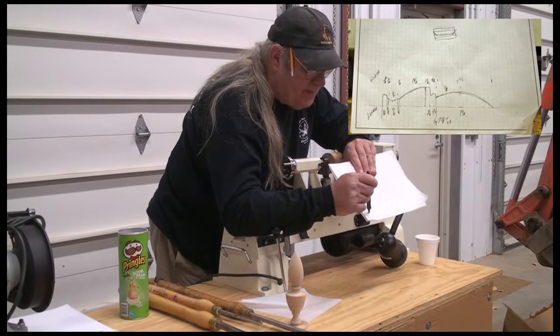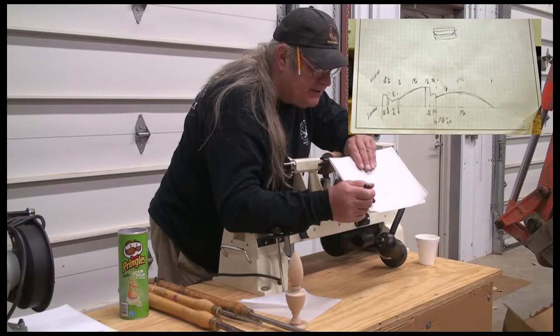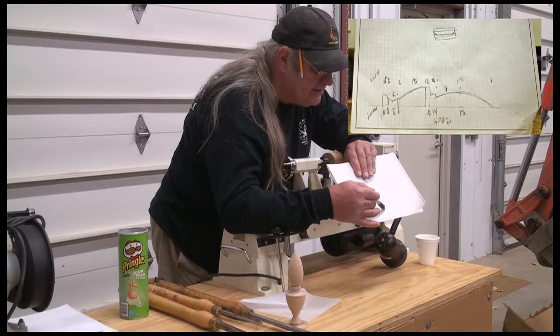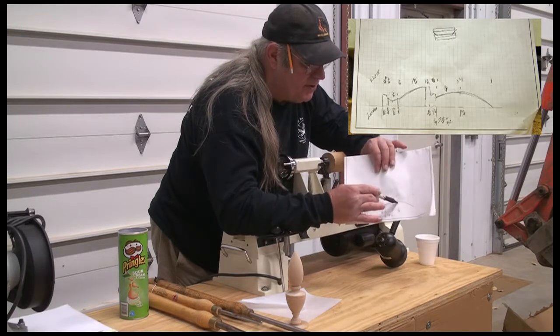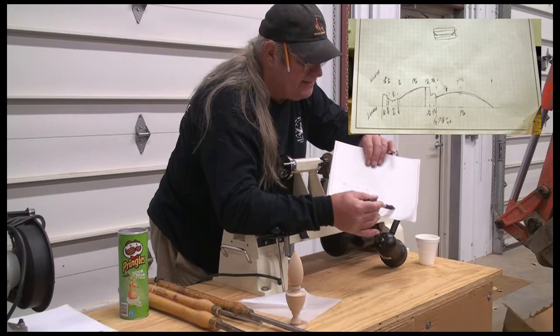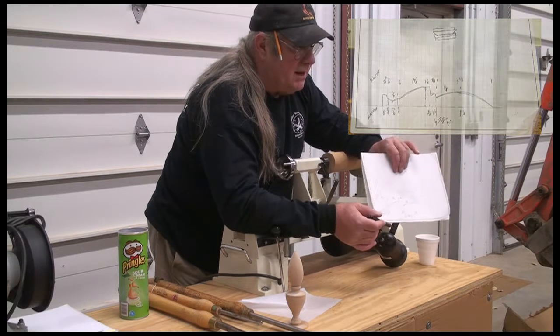And then across the bottom here, I've got the length delineated. A quarter inch, a 16th, 7/16, a 16th. And the whole thing overall is 7 1/8. This is an inch and three quarter. This width here is an inch and a quarter. It said it was 3 and something, but it's an inch and a quarter. And then this is three and 3/8. So the height and the length are delineated here.